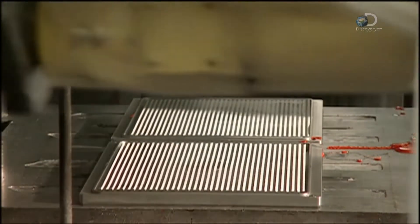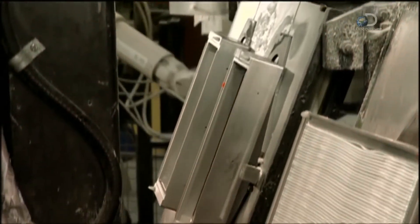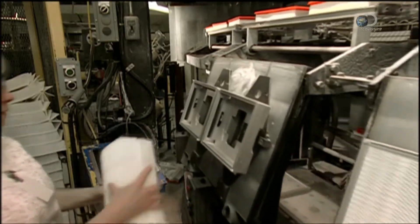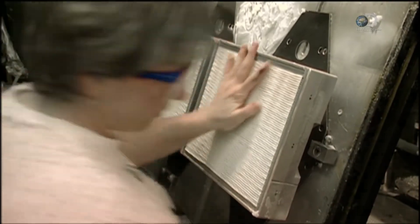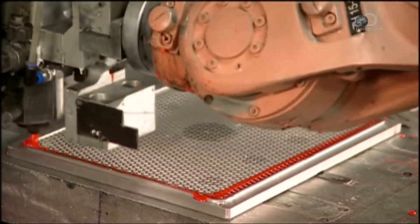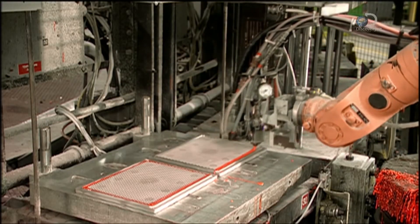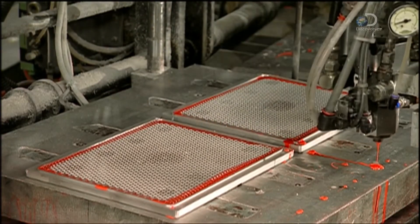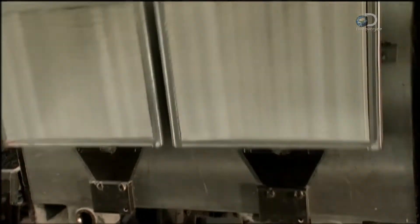A plate bearing two top moulds flips forwards on the carousel. The carousel turns, and one paper pack is placed on the top moulds. A robot then dispenses a liquid polyurethane mixture around the screen in the bottom mould. The automated plates flip back so that the top moulds with the paper packs face downwards.